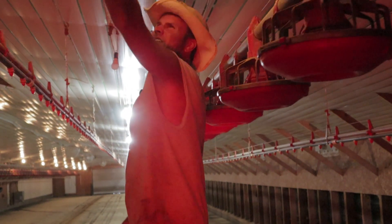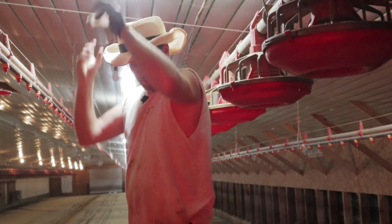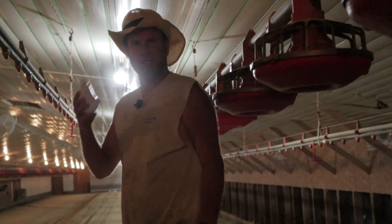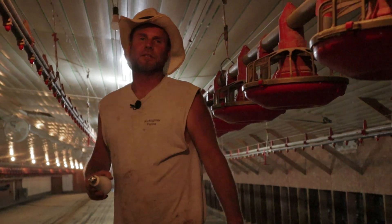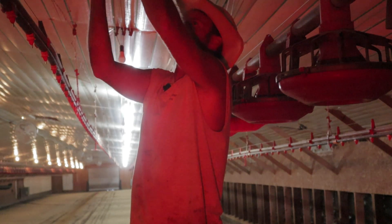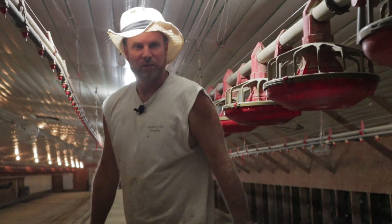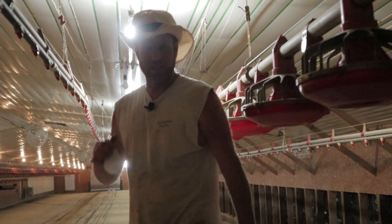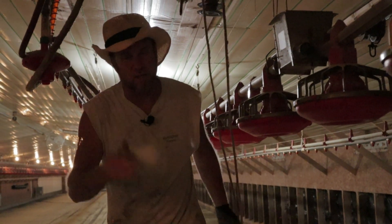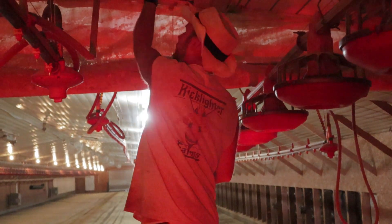When you change to these LEDs — and this is a 17-watt bulb — they cost me $5 a piece, got them off Amazon. They're 5000 Kelvin. When you go to the LED and you dim them — I just put 50 percent after about a week — three weeks at 50 percent dim. These bulbs actually dim down, and when you dim them the wattage goes down. So 50 percent would be 50% of 17 watts.